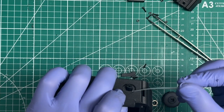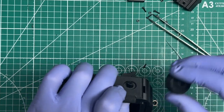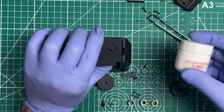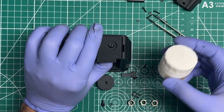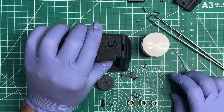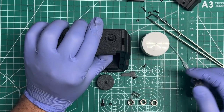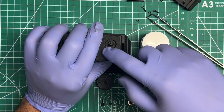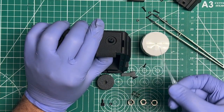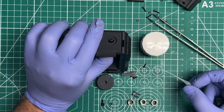You don't want it to be too much, because then it's going to spill and it's going to glue your knob. So herein is another trick that I use, and here's where the helicoid grease comes in, or any other grease or Vaseline. Let's say you're crazy gluing somewhere where you have such a tight surface where it might spill over or drip into something. I actually lubricate that a little bit. I don't do any more because I've gotten really good with these. If you get really good with one of these little droplet thingies, then you're going to be golden.